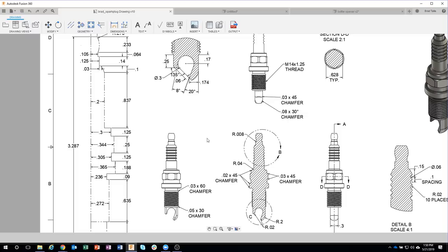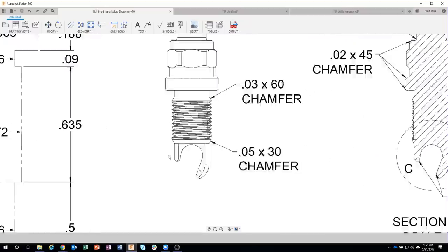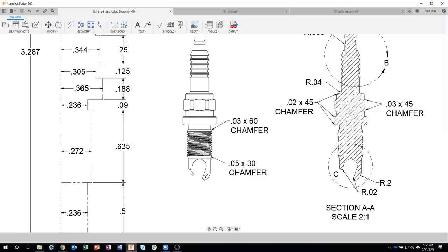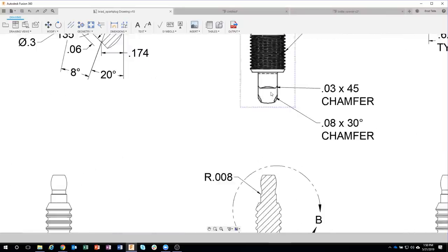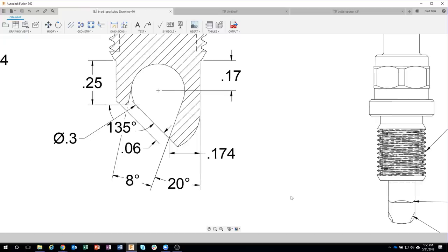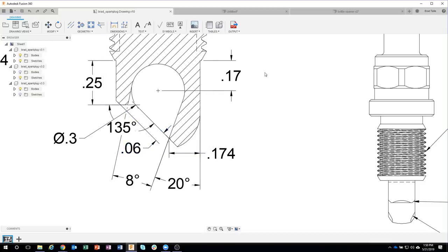it's kind of hard to see, but there is a very slight section right here that's been removed to help catch onto the bottle itself. You can kind of see a little scallop right here, okay? And that is actually dimensioned in this view. We can see that it's right here, okay? So it's 0.06 from this face right here. It's kind of hard to highlight, but you can see here's the 0.06 dimension. So we need to machine just a little bit off right there.